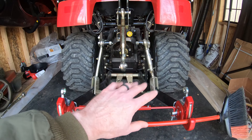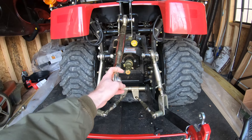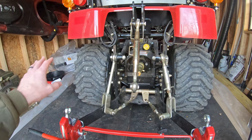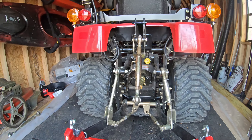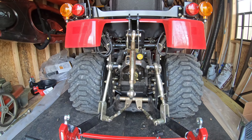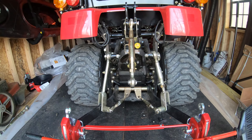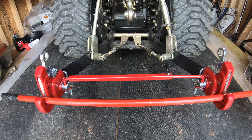Some of the main differences between this and a regular quick hitch: it doesn't have the box frame, and you still have to get off your tractor to hook things up — it's not quite as easy as a quick hitch system. But interestingly, people with actual quick hitches who compared this to it actually preferred the Pat's, because you don't have to get beyond the box frame to get back to your PTO shaft. I guess that's some people's reason to go with the Pat's over a box-frame quick hitch.